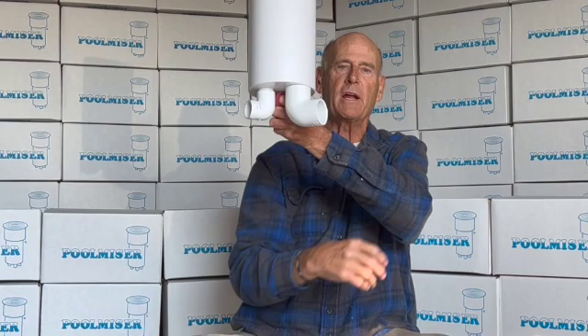The only thing you need to be very careful about is when you install it, don't create a situation where air can collect at the top of the pipe. The equalizer line can run directly to the pool, you can have a dip that goes down, you can elbow it down and then back up again — but you cannot elbow it up, over, and then back down again, because you're creating a space where air can collect. Once air fills that area, there's no more communication between the pool and the tank itself. So a straight equalizer line with no bow upward. Let me turn it this way: as this runs to the pool, make sure it doesn't bow up — it can dip down, it can turn and go that way, but you cannot create a situation where air can collect up in that upper section. That's very important.